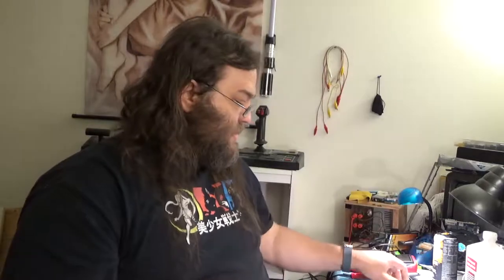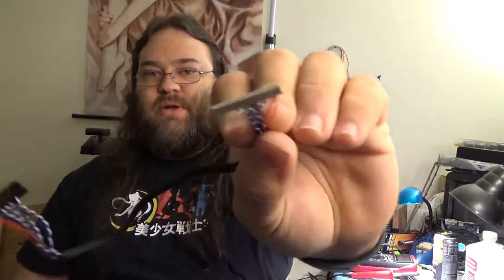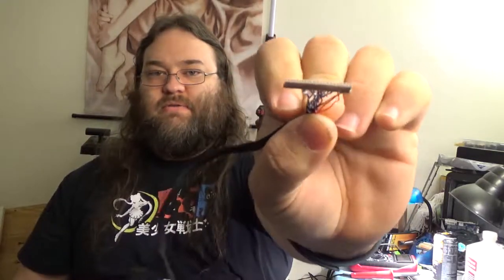So we do still have the schematics and the ribbon bus that we were working on earlier, as well as the header for this ribbon cable. So what we're going to do, which won't waste any parts or affect this at all, we're going to go ahead and solder the wires to this header. And if we do that correctly, we'll be able to actually plug those wires into the points of this adapter, or of this connector, and just adapt between the two pinouts.